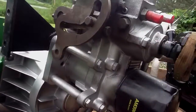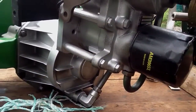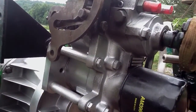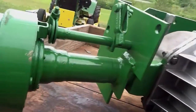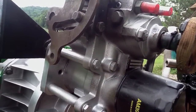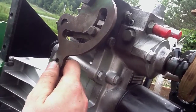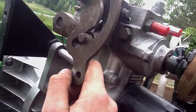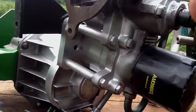What this is doing inside the pump is it's a rotary nine-cylinder piston pump, and the motor down here is a rotary nine-cylinder motor — they're basically the same thing. In the manual they call it a swash plate, and it actually moves on this pivot right here. In the neutral position it's pumping no oil at all. You move it a little and it's pumping a little bit of oil, a little bit more, and at full travel it has full capacity. Here it's pumping the complete opposite direction. The manual really helped me understand how this transmission works.